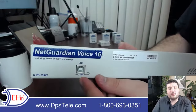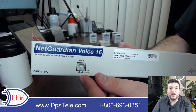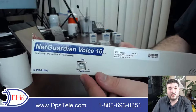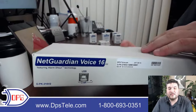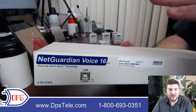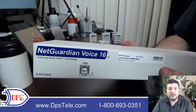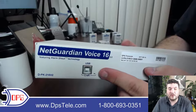On the front panel, we have a USB craft port. This gives you access to a terminal interface that you most likely won't need. However, you can use it for advanced debug and other functions unique to this interface. In general, you'll use the web interface to do configuration and monitoring — it's a good web interface that gives you access to all the functions you need. But if you want to do some advanced debug, this can be handy if you have a tricky network situation you're trying to work through.